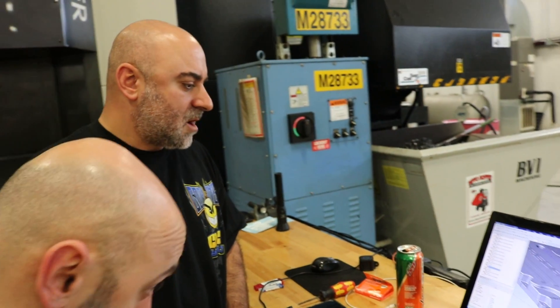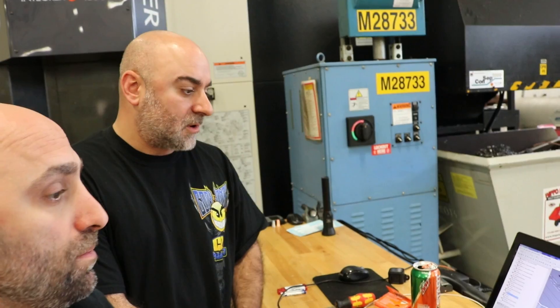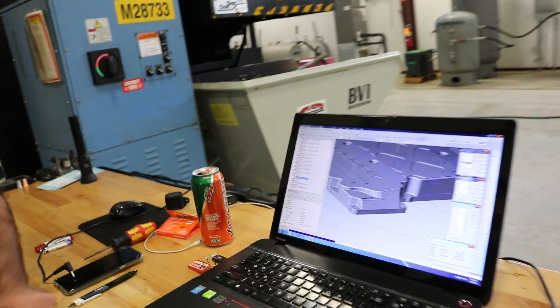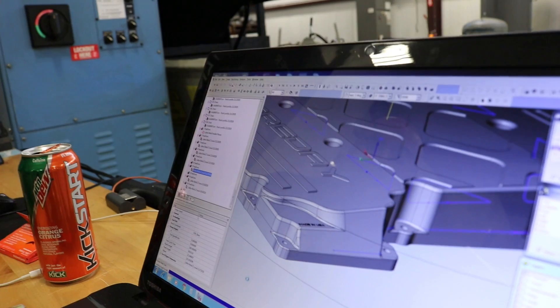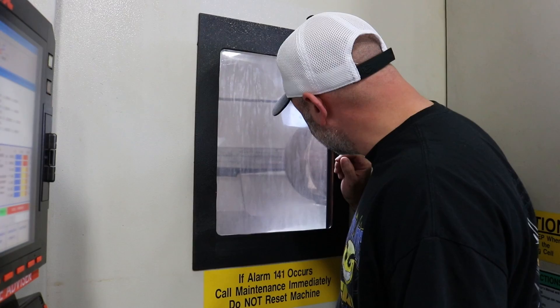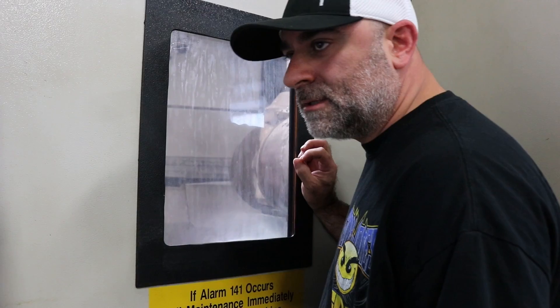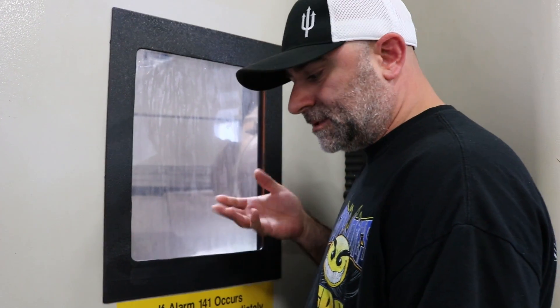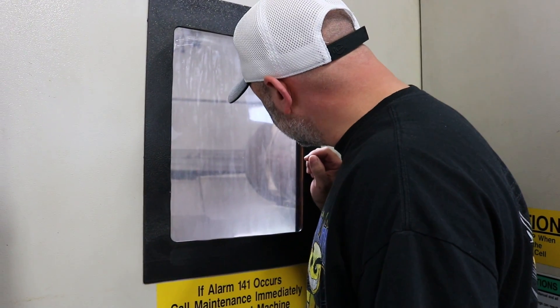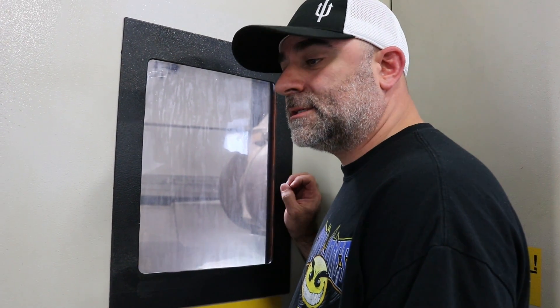What we're doing here is simulating toolpaths on the radiuses on the part. We're adding some radiuses where there are sharp edges right now, so that when the customer goes to install it, they're not cutting their hands on a sharp part. On this operation, we're creating the raised lettering portion of the part, using a really small end mill to actually bring the letters up above the surface and outline them.